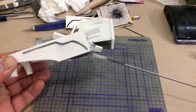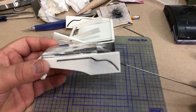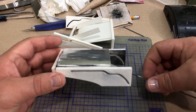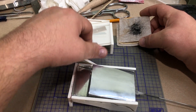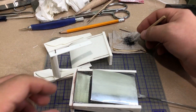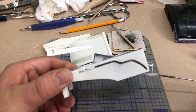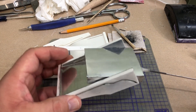That's way easier on the servo — I'm using next to no force. Another key pointer: before I assembled this I put on the aluminum foil tape, and it was a bit rough to move at first, which I expected. So I used a pencil and some sandpaper — you scratch some graphite off the pencil onto the sandpaper and put a little down in the hole. It helps smooth things out. That's why it looks kind of messy. That's pretty much how it works and how it goes together.